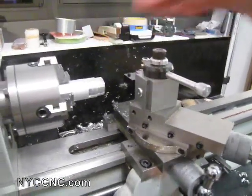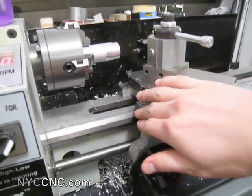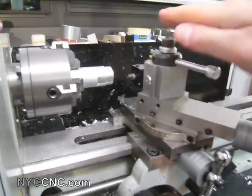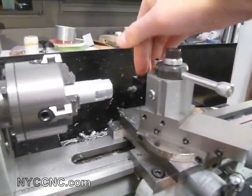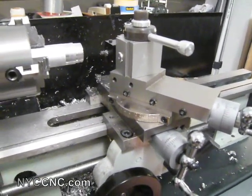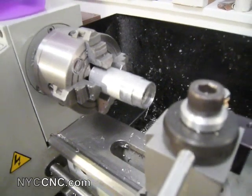The way the tool is loaded up requires a very rigid setup in your carriage, which has a lot of sort of weak points — whether it be through the bed ways, the gibs on the lower saddle, the compound slide gibs, or even in my case a quick change tool post or in your tool holder. So I finally did some tweaking and I've got it to where it's working really well, and you can see I'm comfortably making cuts as I need to.